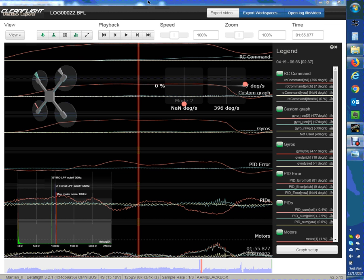One of the things that comes with looking at blackboxes of different machines is: what is good motor noise? No motor noise is good motor noise, but what is a good target to shoot for in terms of vibration levels for what your gyro is seeing? There's a lot that needs to be done nowadays with soft mounting because the newest gyros on these flight controllers are very sensitive — more sensitive than F1 boards. F3s, F4s, and F7s are even more sensitive to vibration noise, and although more sensitivity sounds like a good thing, it results in some bad behaviors on the quad.